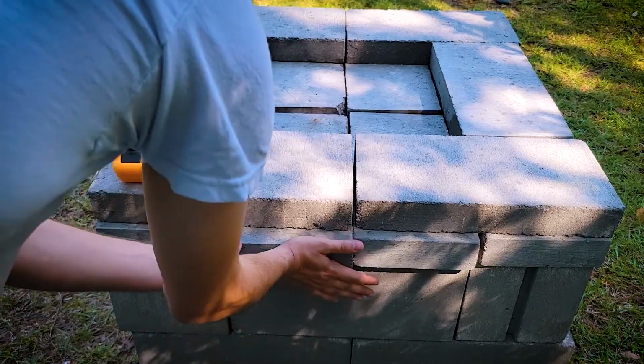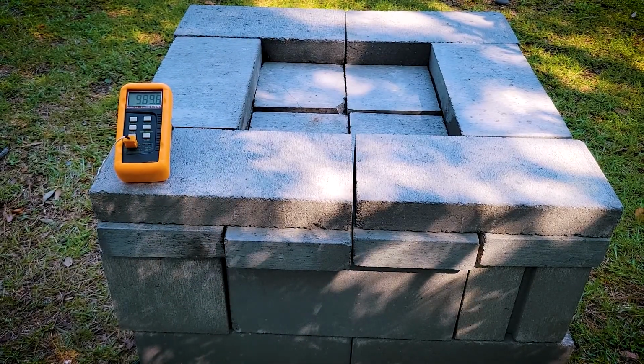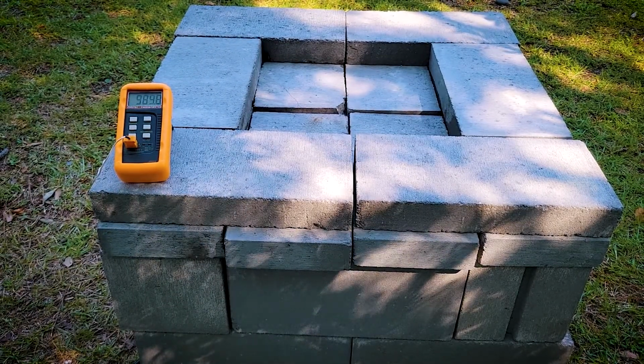The more I open them, the more air I let out, which is unfortunate because you're losing heat. But if you close them all the way like I had it, it's also super inefficient because when you try to add in new propane and oxygen, there's already a lot of air in there and it just doesn't take very efficiently to it. So I found a way to get the right amount of opening, basically as small as possible, but enough air can escape that you could replace it with fresh fuel, and it made things so much more efficient.